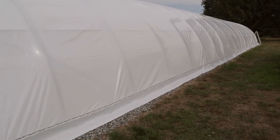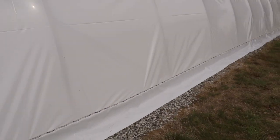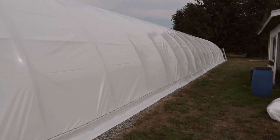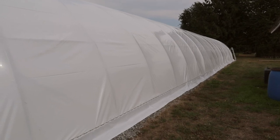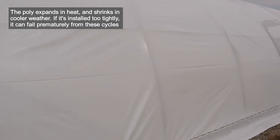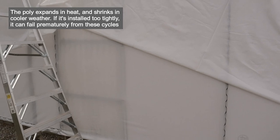There it is, all stretched over the top and now pinned in with wiggle wire across the base and on all sides. We did a quick job of it because I'm starting to feel some wind come up. The next thing we're going to do is unpin the ends and then stretch it a little bit to get the slack out. You don't want the greenhouse poly to be totally tight, but you don't want it loose to the point where the poly is flapping in and out with the wind either — that just puts more wear and tear on it. Obviously we've done the end as well.